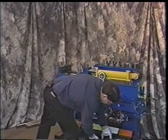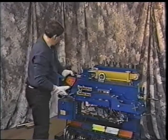And again, we'll want to use 2 1/4. We'll note that that's an orange die. So we want to get down into the orange die, which also on the top of the orange die, it shows that it's a 2 1/4 and it's a 4-inch shoe.